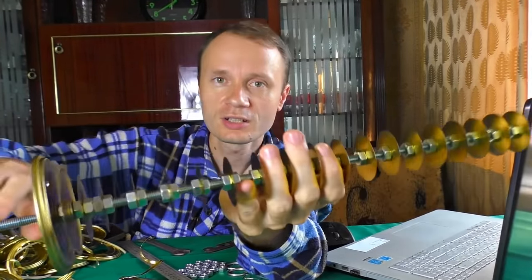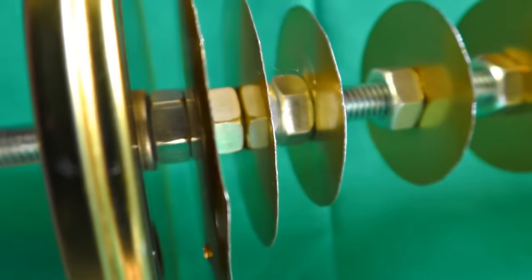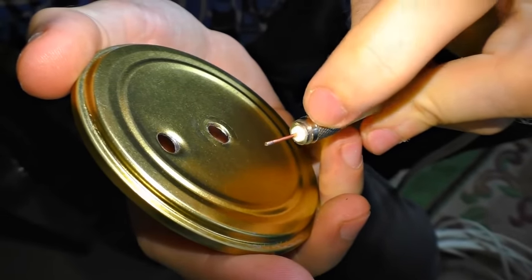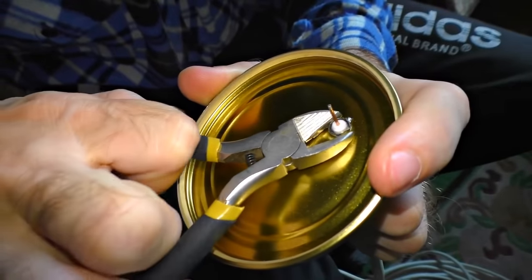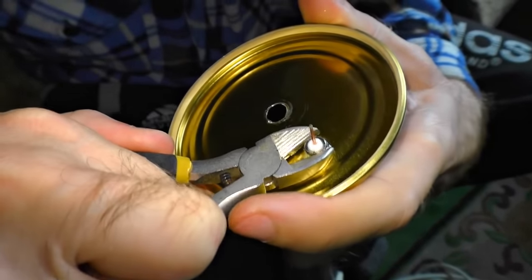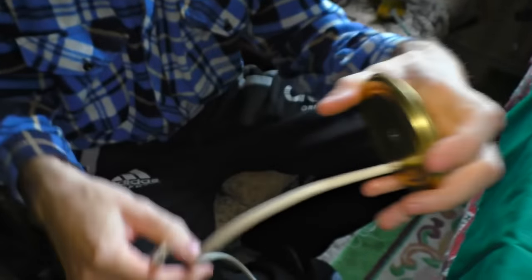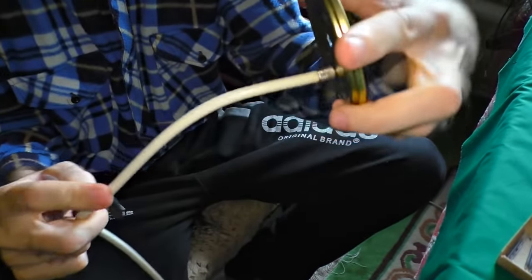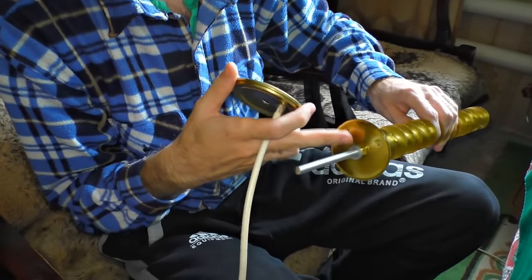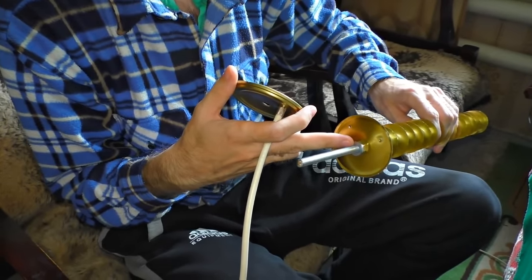The only thing we need to connect is the wire, and then we can test it. Connecting the wire must be done very carefully — no mistakes. Otherwise the antenna will not work at all. I'm going to teach you how to make it with no soldering. Do you see this frame? We should clamp it with pliers. As you can see, they suit perfectly. It will provide reliable contact and firm wire fixation. It is connected so firmly. If you have two wires on your Wi-Fi modem, you need to connect both of them to this antenna. The difference in the holes must be 90 degrees — this way you will have a nice signal because the antenna will have double polarization.